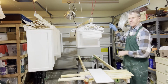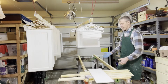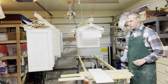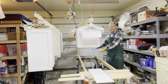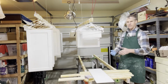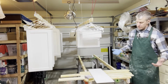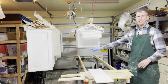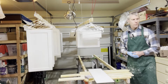I have 2 infrared lamps, and I have a fan, and those go on them after it's all dry, and I have some area here to lay it out if I need. What I was trying to see if it made a difference was, after I roll on the primer, I set the door down over here so it can settle down horizontally rather than dripping, because if there's any thick spots, you'll get some runs or some sags. So I don't want that. I am using this table a little bit, but as you see, I don't have the other one because I don't need it, so I just removed it. Just one process after another, one phase after another.